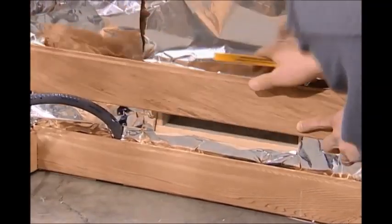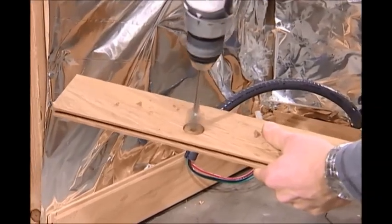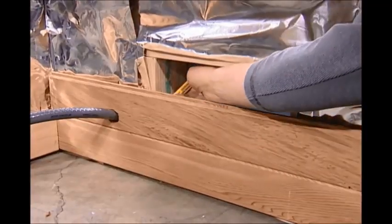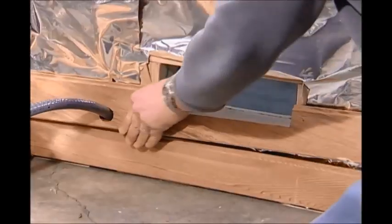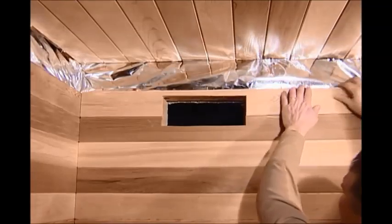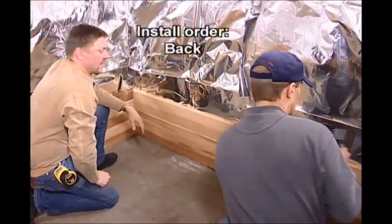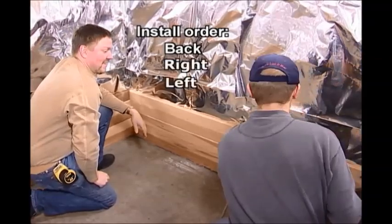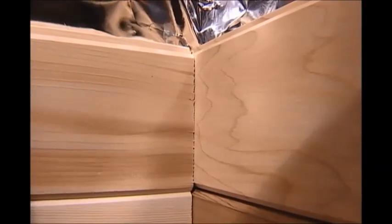To facilitate where the heater wire enters the room, measure and drill a hole in the second layer board. When you come to a vent hole, mark the back of the board from the inside or outside of the sauna, cut the board, and reinstall. Install the boards layer by layer around the room in the order of back wall board, right wall board, left wall board, and front wall boards, making sure the layers line up evenly. You may use a pry bar to butt the side wall boards tightly against the back wall.